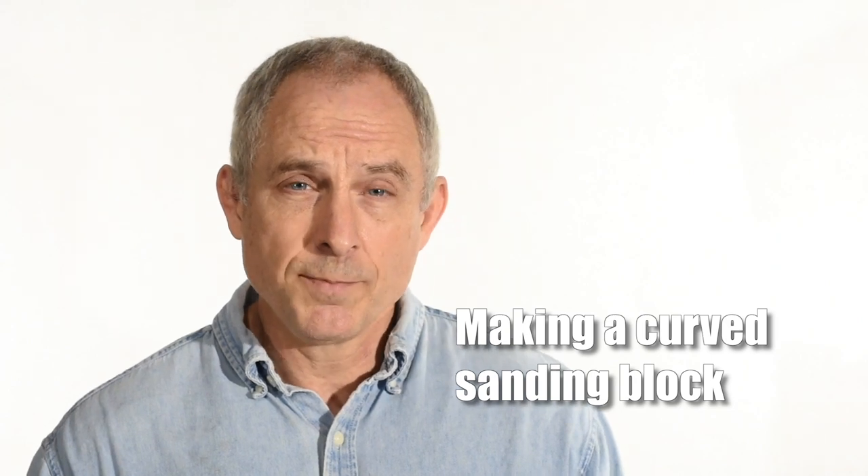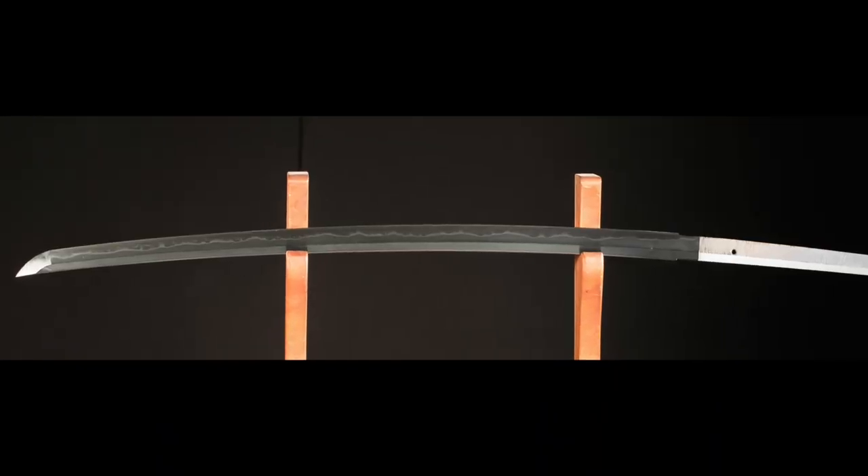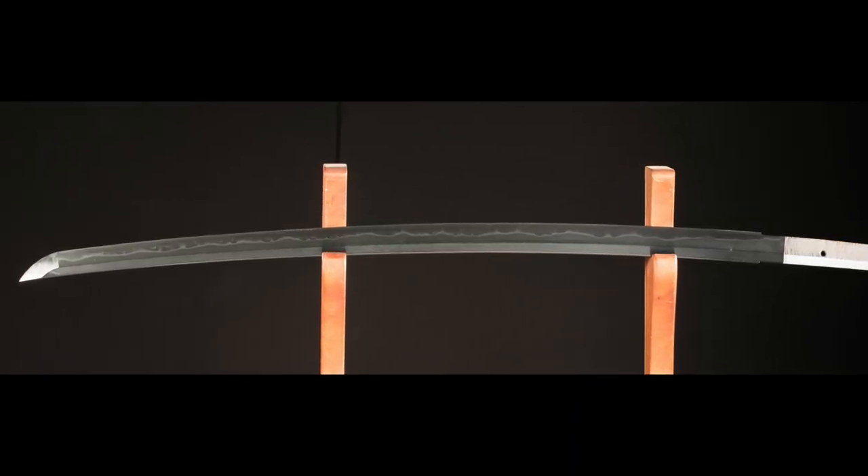Let's turn to a minor problem in making various blades, including Japanese swords. The spine of a Japanese sword has an interior curve — in other words, it's curved away from the edge — and that means when you sand or grind it, you have to use a crown stone or something curved. Otherwise it won't match that curve, it'll bite into the edge, and you'll get it all gouged up and it just doesn't work very well. So let's make a little sanding block that will conform to interior curves.